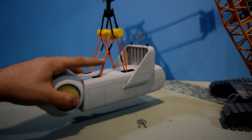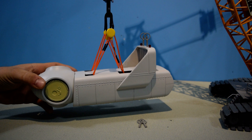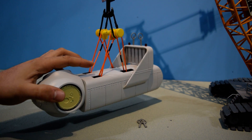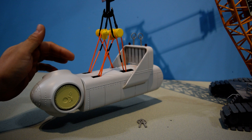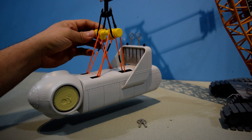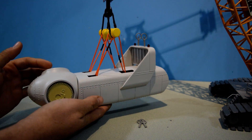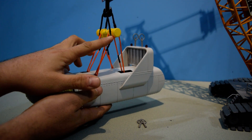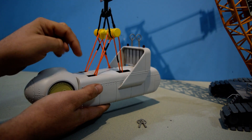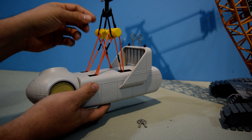Just make sure you have a good crane to hold it up. It comes with all the rigging. The two orange slings on the front are slightly longer than the ones on the back, and that is to keep the nacelle hanging level. So when you get it, make sure you know which ones are the longer ones — they go on the front. You have two thicker black slings on top that go from the spreader bar to the hook. The spreader bar is metal. To attach everything, I would put the orange slings on the spreader bar and then put all of it onto the hook without the nacelle first — this way it's a little easier to attach, otherwise you're trying to hold the nacelle and attach all the slings.